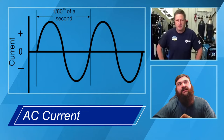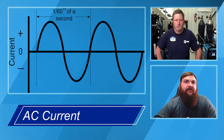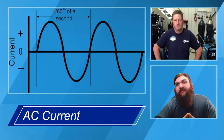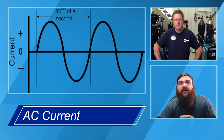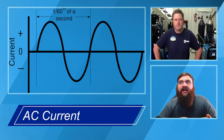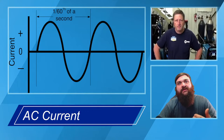This is an old sine wave — technology from the 50s and 60s. As we look at newer inverters, that line is truly vertical. We can actually break this wave apart and change every side of it if we wanted to. The big advantage is we don't have that inconsistency across the zero gap where the arc is going to go out. The newer machines can actually take high frequency — which was another part that helped stabilize that arc — and remove it completely. In doing that, it's also going to change our tungsten prep.